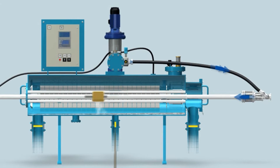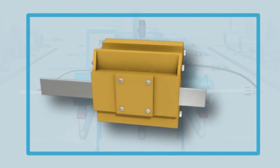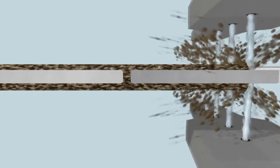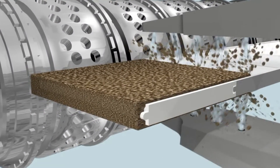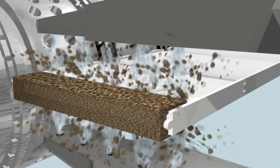The flushing control valve opens, allowing the boosted water to flow into a shuttle pipe fitted with a movable spray unit. The spray unit moves back and forth along the entire length of the cartridge, pushed in both directions by a boosted water pressure driven piston. Each spray nozzle creates multiple jet streams. The water jets pass through the thread layers, hit the plastic wall, and are forced backwards, creating a powerful spot back flush which carries the trapped particles and filter cake out of the cassette's thread layers and through the open drain control valve to the gravity drain system.